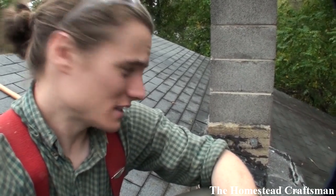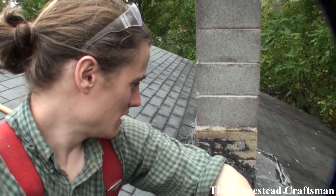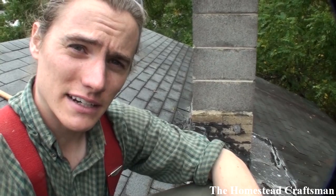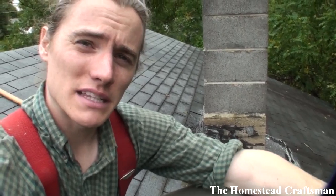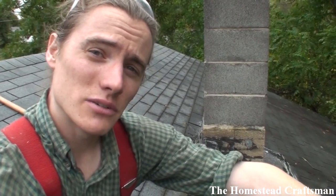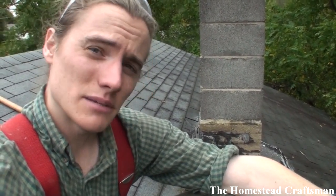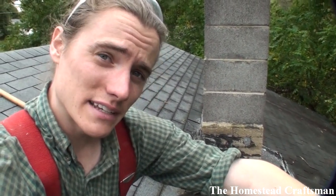All of that is being removed — this house is being updated with a heat pump. So I'm going to take this chimney down because I need to re-roof it, plus it cuts into the space in the laundry room and causes roofing issues. This is a house I'm completely renovating. I'm going to take a sledgehammer and bust it up at the top and work my way down all the way to the basement, but for right now I just need to make it through the roof so I can reframe the joist, drywall the ceiling in the laundry room and kitchen.